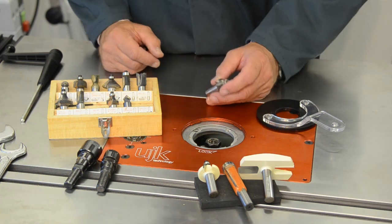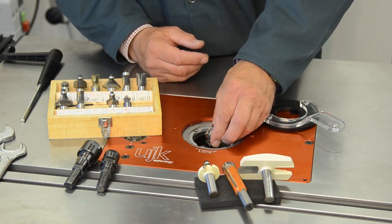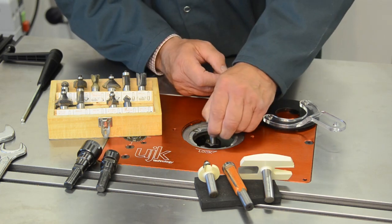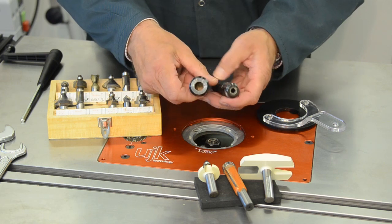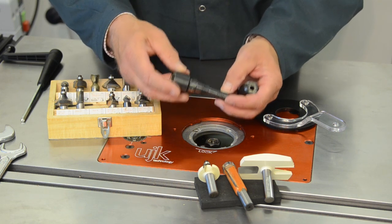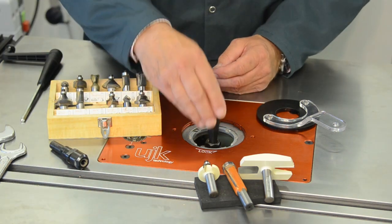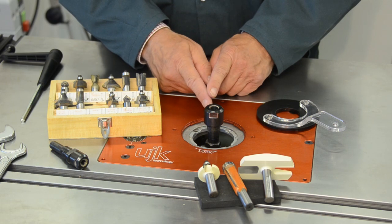A common characteristic of every router table I've ever used is that even when the router itself is as high as it can possibly go, when you put a cutter in you can't always get the height you need. The danger is you might risk holding the cutter with too little of the shaft into the router. So I've had for a number of years these router collet extensions — I bought them from Axminster and they must be at least 10 to 15 years old. I understand they still do something very similar, perhaps a fraction shorter, which would actually be quite a good thing. I've got a quarter inch and a half inch, and I'm going to mount the half inch one in permanently, which will also make it easier to change tools.